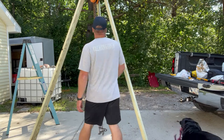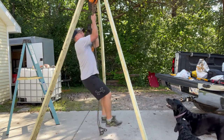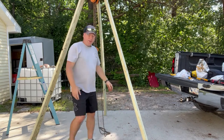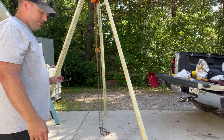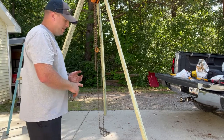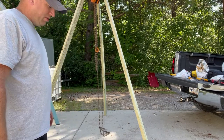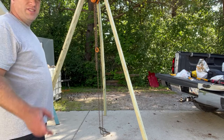I got the chain fall hanging from the chain up top. For those of you that say it's not going to be able to lift anything — I'm about two hundred and thirty pounds and I can hang off of it pretty easy. Not too much flex in these legs. So I would say this is something that you're going to lift less than five hundred pounds with. Mostly because if it does happen to break — first of all, you're going to really probably damage the headstone. But if one of these legs was to break and it fell on you, even something three hundred to five hundred pounds falling across your leg, you're going to be in a world of hurt. So I think this will work perfect for her and I hope she enjoys it. Let's go out to the cemetery and see how it works for ourselves.